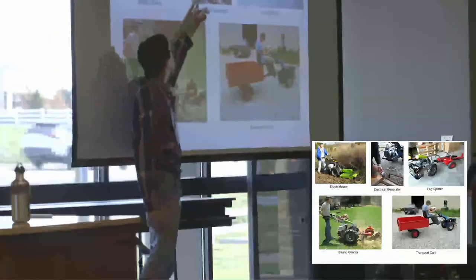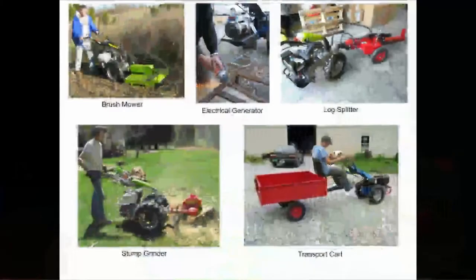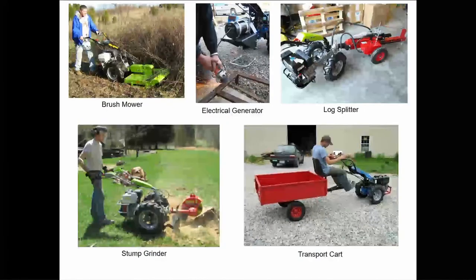We actually build the generators at our place. We're like, well, we've got a PTO. We might as well use it to do something. So we buy the generator from one company, and we have a local fabrication place make up the frame, and that's belts. We use belts to drive the generator because we needed a cheap way to step the power up, and it was a lot cheaper than making a gearbox. And since it's a constant load like that, you're not losing all the power through the belts.